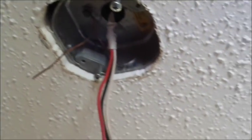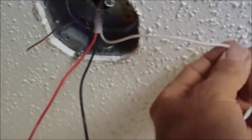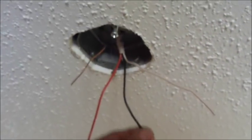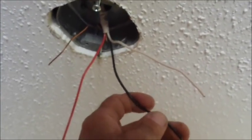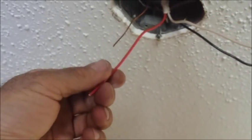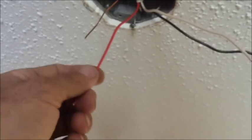Now we're going to install the fan on another video — this video is just how to do the wiring for it. So just want to remind you of the way we set this up. Here's your neutral wire. The black wire is our hot wire, which we want to attach to the fan itself so that we can use the pull chain for high, medium, low, and off. Whether the light is on or not, we'll have power to the fan so we can use the chain. Then the red wire, which is attached to the switch, goes to the light — so whether the fan is on or off, we can have power to the light. When we come in the room, we can flip that switch and expect to have light.